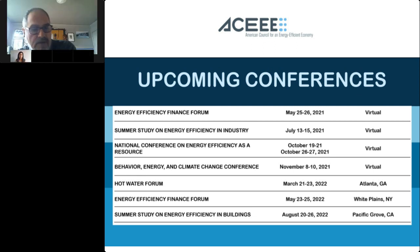We actually have a building for a major healthcare provider, a clinic here in the Bay Area, that has just been built with single temp for the hand washing fixtures. So it's really jurisdiction to jurisdiction. That question's a really big one. I have had pushback from some jurisdictions that are a little bit more conservative, and they haven't really parsed out the fact that the UPC is really aimed at preventing scald. It's not trying to set a low end temperature at this point. That's not that clear. The IPC is a little bit more clear, saying you have to have that hot water for hand washing. But we have done it, and it's really jurisdiction to jurisdiction. I've been talking to jurisdictions about this for a while, just trying to soften the field for the concept. But we do have one.